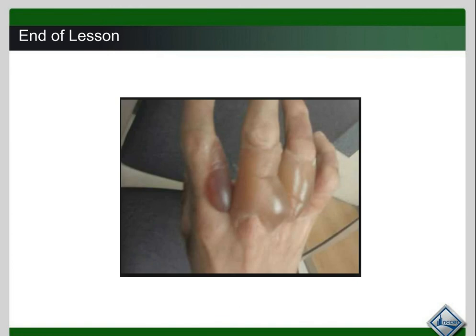This is not me, but this is a picture I pulled down from the internet — I have seen this. This is an example of a refrigerant burn. If you get in a panic and refrigerant starts spraying and you're trying to put a cap or your hose connection back on there, that's what's going to happen to you. You need to wear gloves, or be smart — if it starts to spray, you just need to let it go. Be safe.